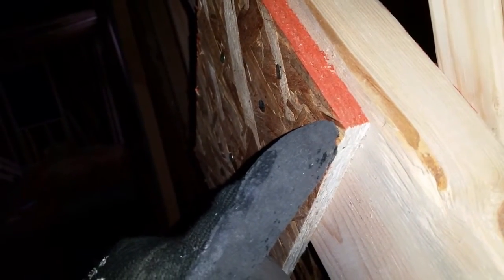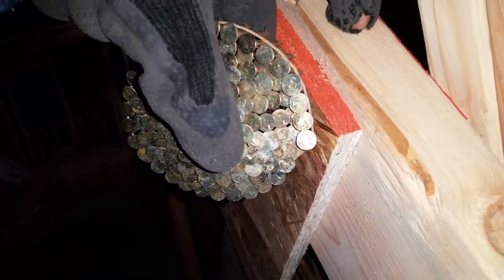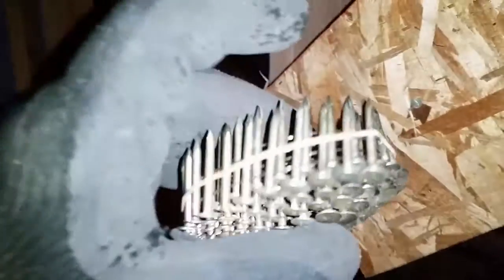You can see the exact same nail head — it's inch and a quarter long. They've got 7/16-inch OSB they're using for a gusset, which leaves about a half inch — really about 3/4 of an inch of penetration into the truss member itself. Not very good, not to mention these coiled roofing nails are very smooth shank, so they'll slip in and out.